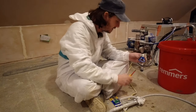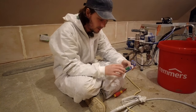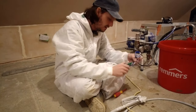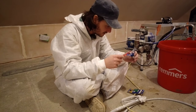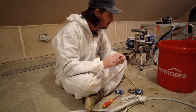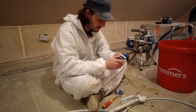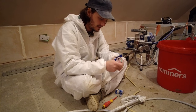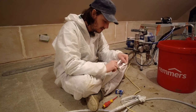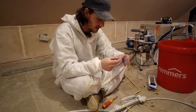I've turned it off to release the pressure in the gun. I need to put this guard on here. I bought a new tip - this is a 517 low pressure tip. I had to guess at the 517 because this paint I've got is not designed for spraying. Normally you're supposed to be able to look at the data sheets or contact the manufacturer and they'll tell you what size tip to use, but most emulsions, as far as I understand it, you can use a 517.